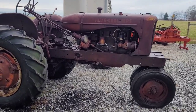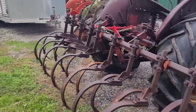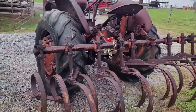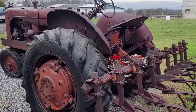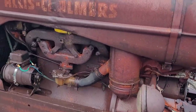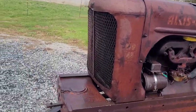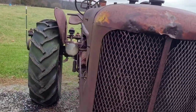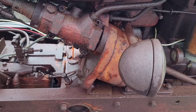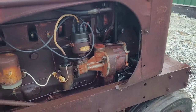That rim on that side is short, so I need a new rim — I think I have one lined up. You'll see later in this video how the tires are flat; they're filled with calcium so I've got to tear them apart and clean them. Right now the motor's stuck, so we're going to clean the motor up, take the valve cover off, take the head off, and see how bad the motor is. Hopefully we can use this motor; if not, we'll have to find a new one. I really hope that power steering pump works — that's the whole reason I bought it.